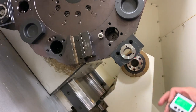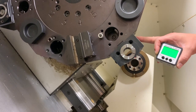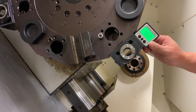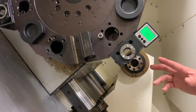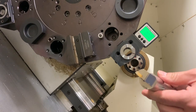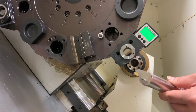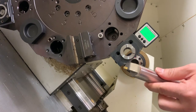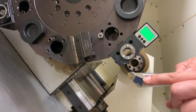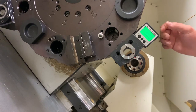If you have a tool post like what we have here, which is going to be sitting in the working position, and if you put the digital protractor there, you will see that this surface is close to zero and it can also be used as a reference plane. After you have found the zero reference plane in your machine, it's time to settle the tool. In my hand I have a 25 millimeter product from MQ where the body has a substantial flat surface made for alignment of the tool.